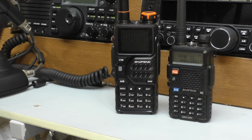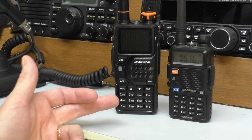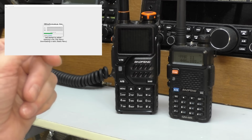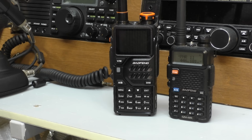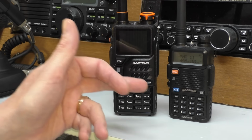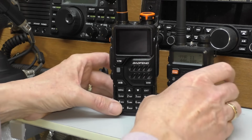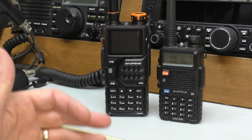It came out about 14 years ago, I think, now, and it wasn't anything remarkable until some clever guy realized that you could jailbreak the radio, you could reprogram it, and you could use it for PMR. So you would have potentially a 5-watt PMR radio instead of 0.5 watt. And then once we realized we could do that, especially with CHIRP and things, it just took off globally. And I mean, hundreds of thousands of these little UV-5Rs have been sold.